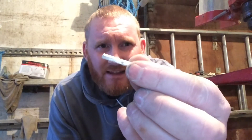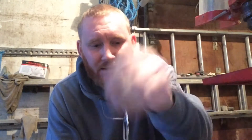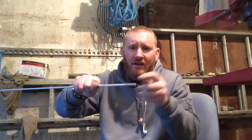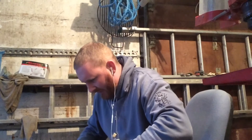For some reason, 6mm pins don't always go in 6mm holes — same with 4mm. All the pins I've done, I reshape down with a Dremel sanding drum, lightly going across it until it shapes down. There are indentations I've put on each of these pins with a Dremel to make them stick better when they're in. A little tip when you're reshaping: reshape on the full bar, because you can hold it better. If you're holding a small pin it's going to get very hot and you'll need pliers — it's a nightmare.